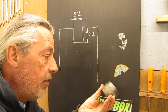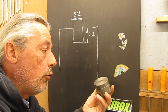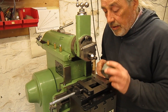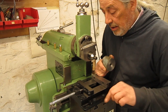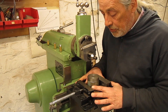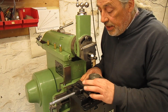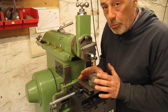This is cast iron and I have a little problem holding it in my shaper. I cleaned up this surface, so no problem there. It would be nice if it could sit on this vice, nice and flush on this surface, and then pushed against the fixed jaw. Then I need a v-block here just to be sure it's not going to move.